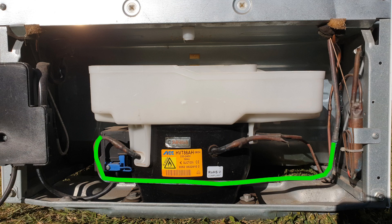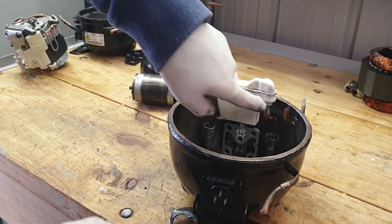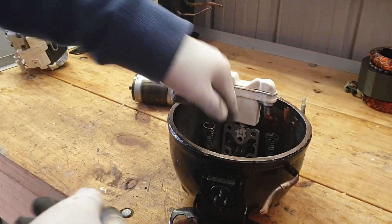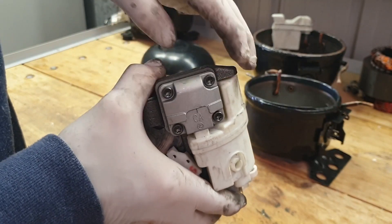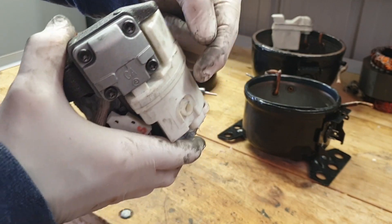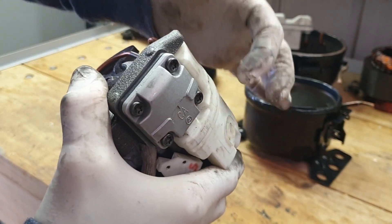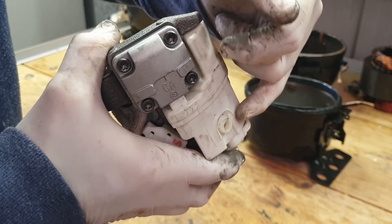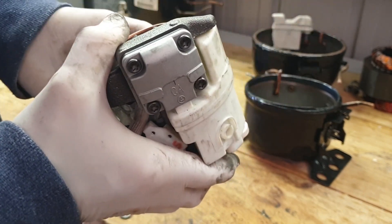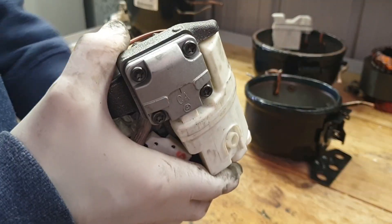The oil will stay there until the compressor is turned back on, which leads me to their claim that the oil will then be harmlessly sucked back into the compressor. That is the inlet muffler. You can see that any oil in the suction line isn't sucked into the compressor — it is sucked directly into the muffler, and the muffler leads down to the cylinder head. Numerous compressor patents relate to keeping oil out of the muffler. The oil sprays all around the inside of the motor when it's running. There is a ridge referred to in one particular compressor patent — its intention is to direct the oil running down the side of the motor away from the inlet. So the fridge manufacturer goes to all the trouble to lodge a patent and put a ridge around the muffler inlet to keep oil out of it, and those other websites claim there's no problem just sucking the oil from the suction line straight in through the inlet there.